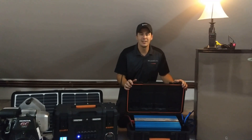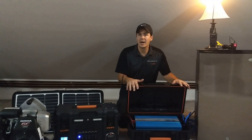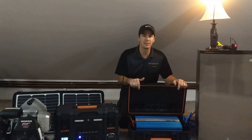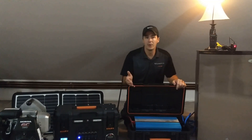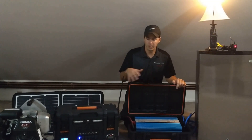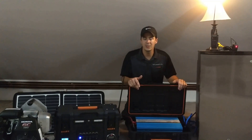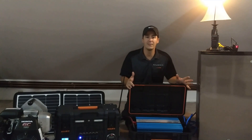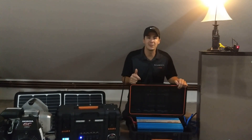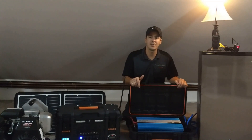Start with the basics — get one or two circuits in your house dialed in, just the necessities. If you have a propane, oil furnace, or boiler, most of those will run off something this size because there's no electric heat source involved — just blowers or circulator pumps, which can typically run off a smaller inverter. You could create a backup setup for your kitchen fridge and some lights to keep your phone or laptop charged, or put this on the heating source for your house so you never worry about the power going out and the house freezing, even if you're away. And you could do this without buying a whole-house generator for $8,000 to $10,000. Sure, it won't give you that capacity, but it's a starting point at a lower price point with at least the bare minimum to be safe for your home. Thanks for watching — get out there and build one.